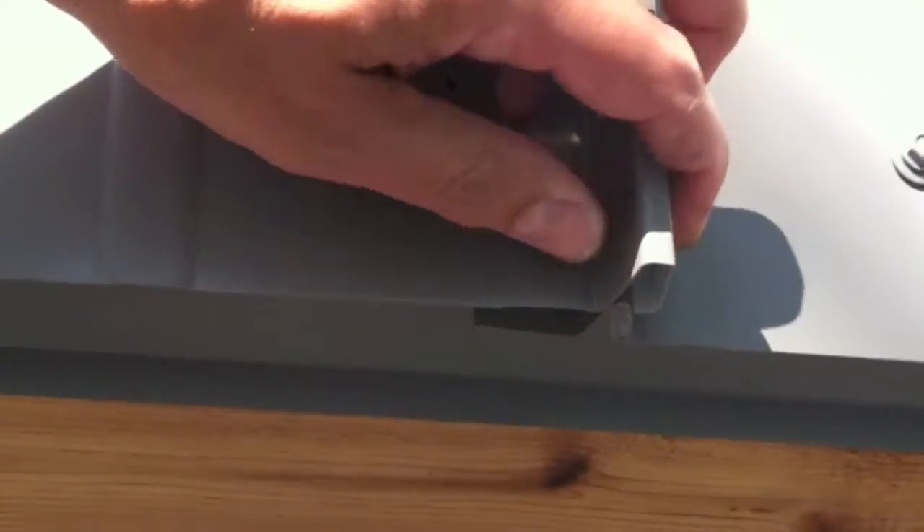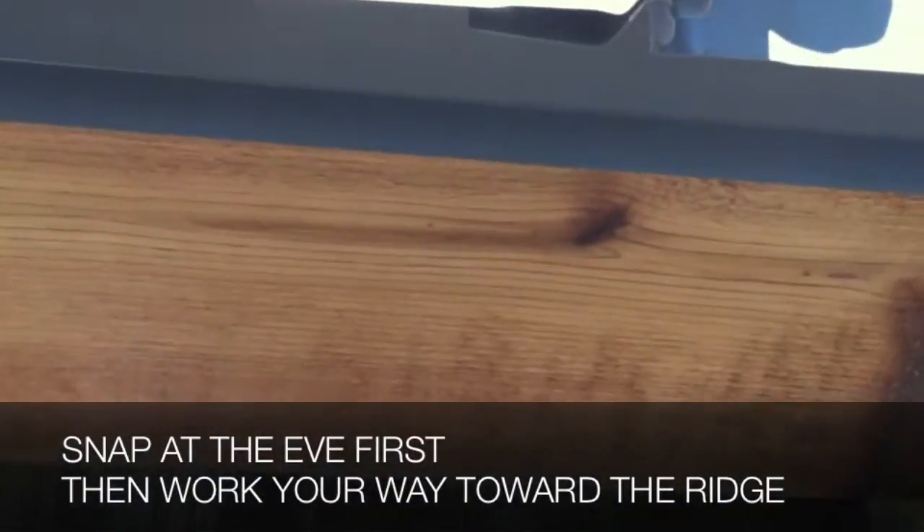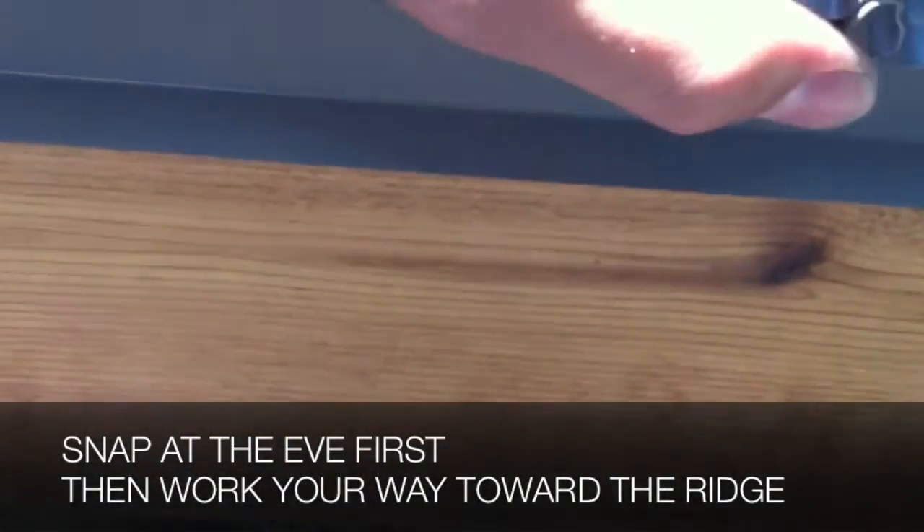At this stage where I've lined up the panels, I'm not going to use foot pressure up here in the field or on the ridge up there. I'm going to use finger pressure or hand pressure right down here, right where they meet, so I can align them perfectly.